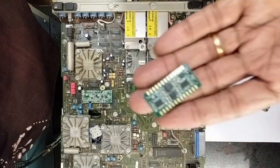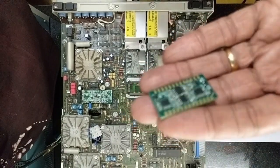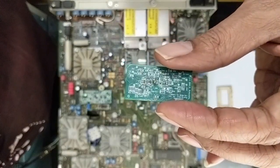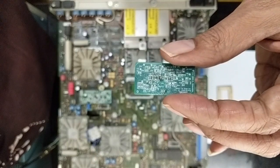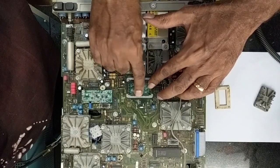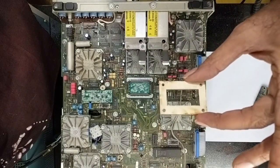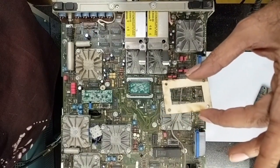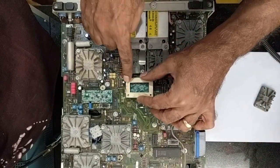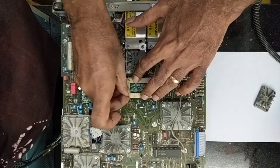The replacement has gold-plated contacts on the ends. That is the bottom side of the board with the op-amps, and this is the top side. What you do is just drop this into the slot, where it is then held in place by a little frame or bracket. This could be made of either wood or acrylic — I haven't quite decided which will work better in the long run. This just goes into place and can then be held down by the same four nuts.